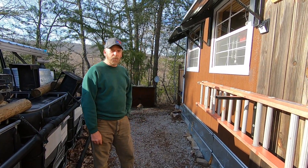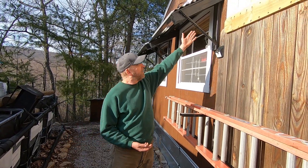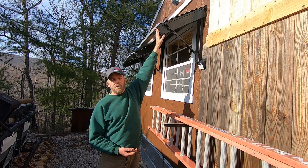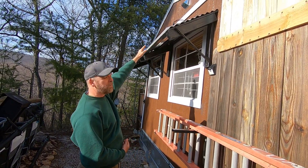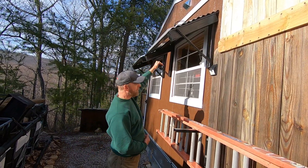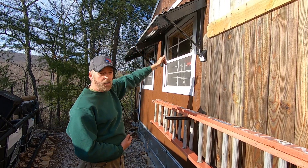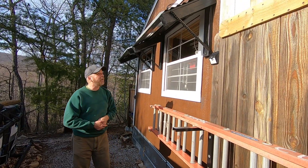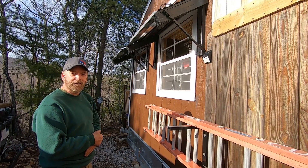I want to add one more scene to give you a perspective of what it all looks like when it's done. It looks like an electrician did it because of the adjustable bars — and that's intentional. I can adjust these to the angle of the sun; right now they're sitting at about 43 degrees, perfect for hitting the southwest sun. They're getting sun right now, which will give me the power I need to hit the charge controller, hit the battery, and power my freezer. It'll also cool the cabin in summer — I checked inside and I'm still getting plenty of natural daylight but enough shade that it won't heat up. It's going to work really well in the rain too. I'm very happy with it. If you like this idea, please subscribe, give a thumbs up, or leave a comment. Have a good day and God bless.